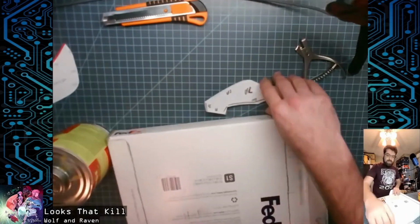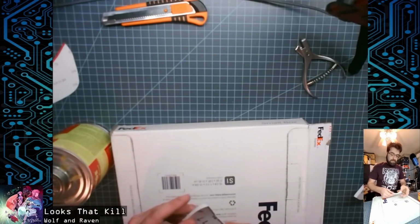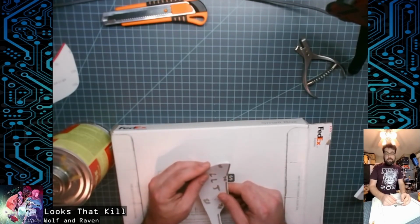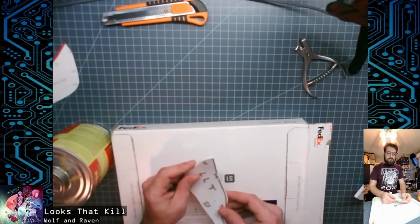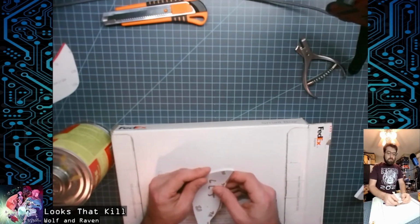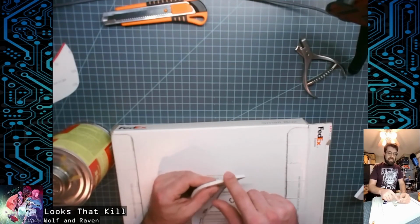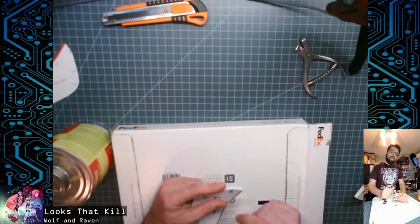With contact cement, it's a little counterintuitive. You put the glue on, a thin but consistent layer, and then you want to wait until it dries. Not completely, you don't want to let it go for too long, but usually about 5 minutes at minimum. Once it no longer looks shiny and it isn't sticky to the touch, then you want to actually stick things together. Then it will adhere properly.